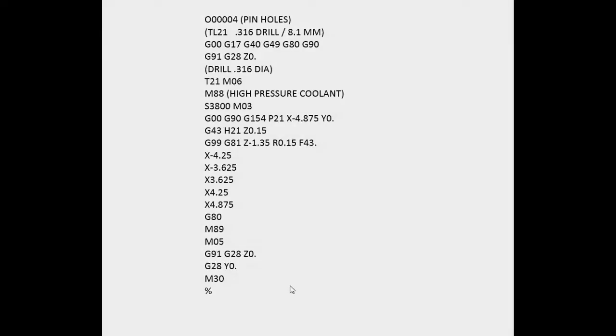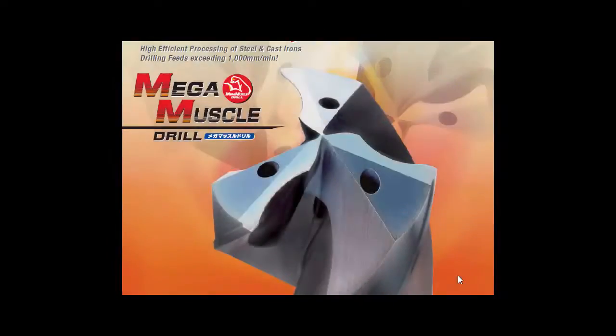Alright, so let's take a quick look at the drill. Here's a close-up of the drill tip of this 3-flute solid carbide drill showing the coolant ports at each cutting edge for flushing those chips as it is drilling at high speeds. Now notice that we didn't use a center drill. These drills are designed to not use center drills — it actually doesn't like it — and therefore it will save you time and money.